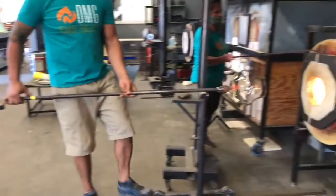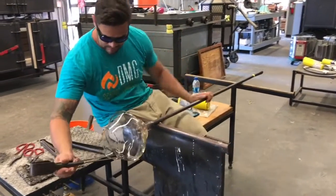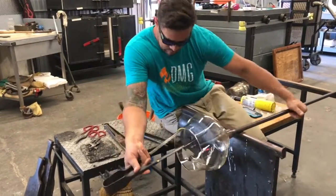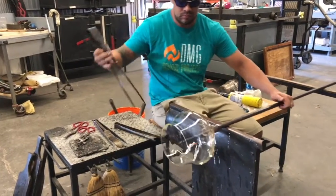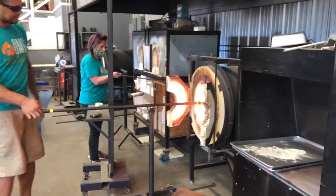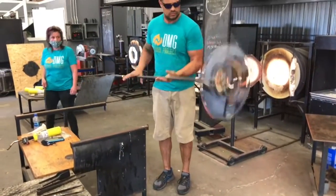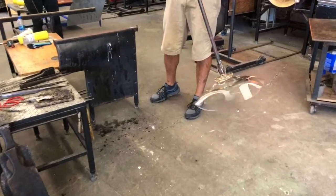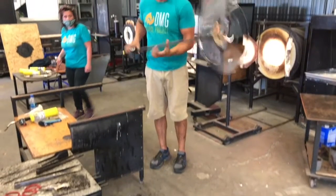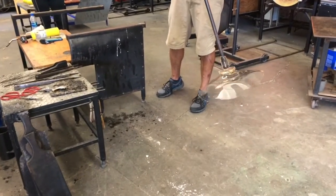He's going to reheat it again to make sure he has enough heat, because once that glass hits the frozen temperature of a thousand degrees, you can no longer shape it. This glass has to stay well over a thousand degrees to continue to shape it. He is always turning the pipe or the punty pipe to keep the glass on center. Now he is going to use centrifugal force and spin that out into a plate, and then use gravity to let it fold down the lips of that plate and give it a scalloped look. You can see the centrifugal force and gravity creating the scallop-shaped bowl.